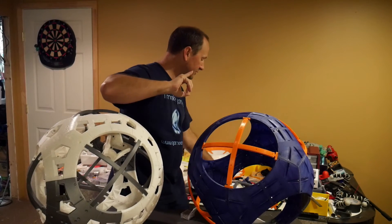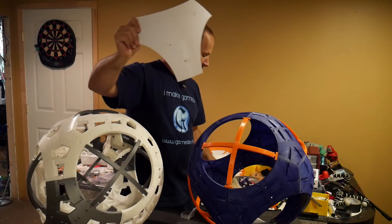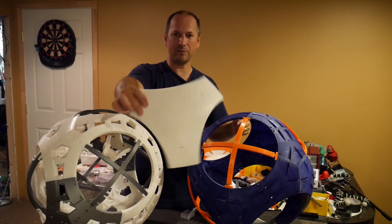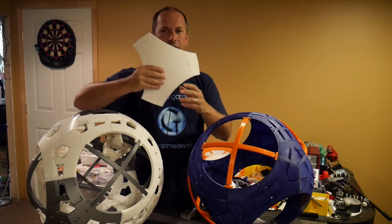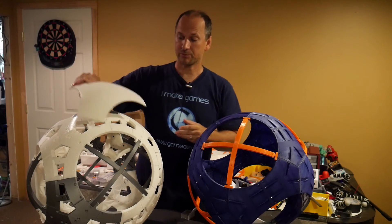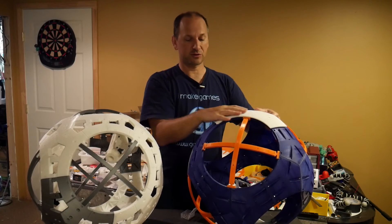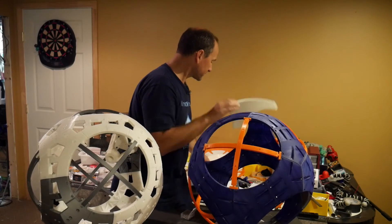Let me take a quick sidetrack on panels. I'd been using PETG and printing full-size club-style panels, which are pretty heavy. In my new lightweight approach I'm printing very lightweight PLA panels with about 2 shells and 10% infill — a little scary but half the weight: around 114 grams versus 280. Backed up by the skeleton I don't think strength will be a problem. I'm also thinking of coating them with epoxy rather than the typical sand-and-fill method, which should strengthen both the panels and possibly the skeleton too.